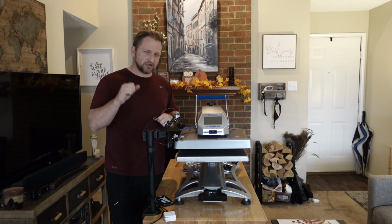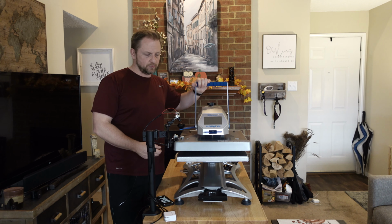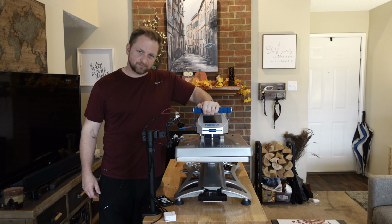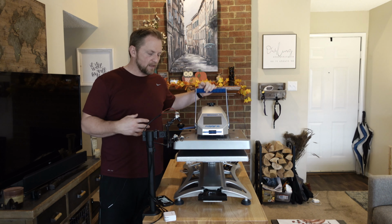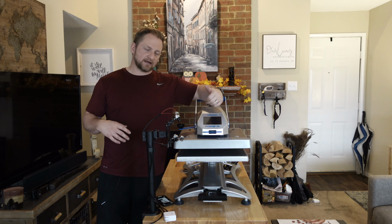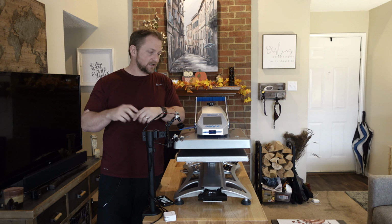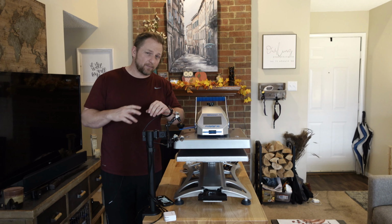And I've noticed that especially if I'm doing a non-locked pre-press, so if I put the garment in to do a pre-press on it and I'm not locking it all the way down, I'm just pulling it, holding it to put some pressure and let the heat transfer, and then I let that go. The time may not go all the way back up to 6 seconds. It may go back to 4 and stop right there. And if I check the computer program, where I've set it, it'll say, yeah, it's set to 6 seconds, but it won't read that out. It doesn't happen all the time.